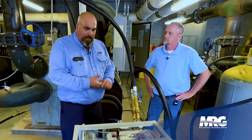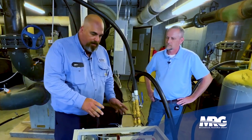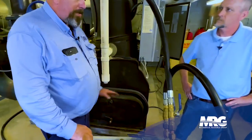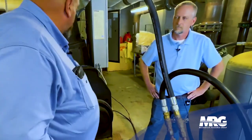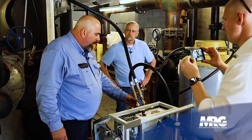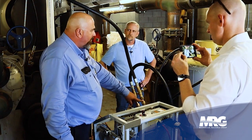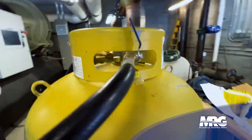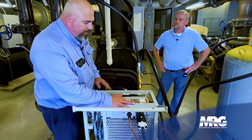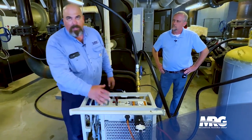Once all the liquid is out, we convert it to a vapor-pull mode. We'll go ahead and isolate these valves, move this hose from our outlet to our inlet, and then get a hose directly from the liquid port to the liquid port on our recovery cylinder. At that point, we can go ahead and start our fan and start our water flow through our liquid-cooled condenser.